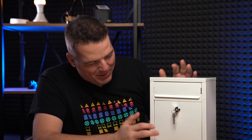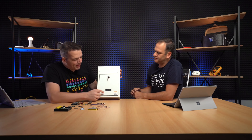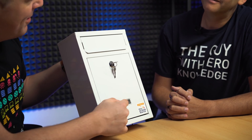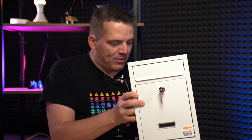You don't see any electronics here because it's got a small problem - this is a metal box and we want to use Wi-Fi and as you might know, this doesn't work well. So there are two options. At home I've got the same and I just place the controller exactly behind this plastic window here, so that the Wi-Fi signals get out - that actually works. You can still use your sign or something like this to hide it. The other option, which is what we opted for here, is to just use a cable and put the box below or somewhere behind.